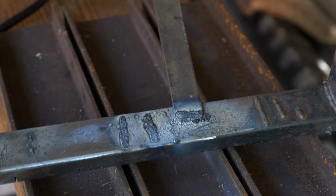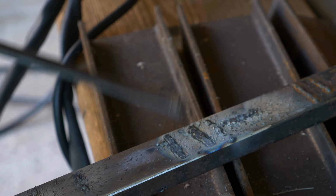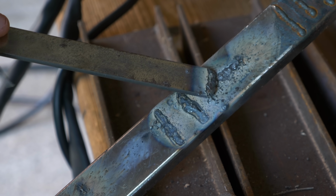100 amps is a little bit more violent. Oh yeah. And here I'm trying to use 120 amps to weld on a steel bar. That's a little bit violent and a lot of splattering. Yeah, this is not a good bond. This is probably my worst weld ever. Yeah, you can see it melted the corner of the bar, but it didn't heat up the pipe enough.